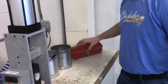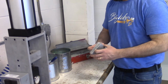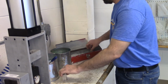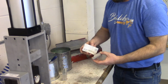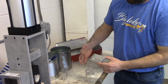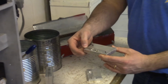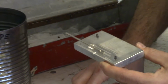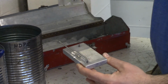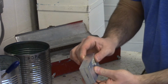Let's take a look at the molds we're going to use for class. These are injection molding molds. They fit together. We have an opening for the material to be injected into. Here's our screwdriver mold. Okay, so we would see that our screwdrivers would sit right here, our bit. We see where the plastic comes into the mold. We also have these indexing pins and indexing holes, so there's no way to put this together in an incorrect fashion.